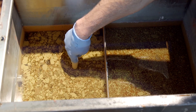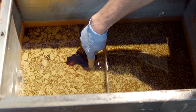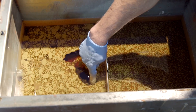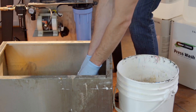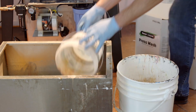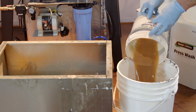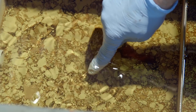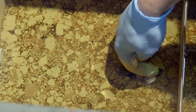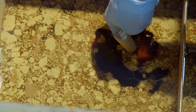When your chemical becomes too loaded with ink, it starts to clog the filter and won't clean very well. Remove your chemical from the reservoir to a large storage container or multiple 5-gallon containers with top pour spouts. Set this aside and let the chemical rest for 3 to 6 months. All of the ink solids will settle to the bottom, and you'll be able to pour the top of the chemical back into the recirculation system. The final leftover ink-filled solution can be disposed of via local recycling service.